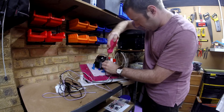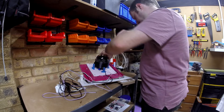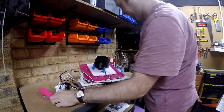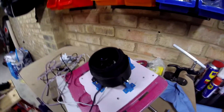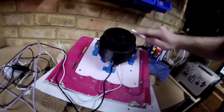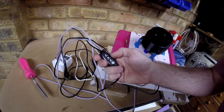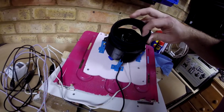You can mount it however you want. There are four screws to take the CCTV dome off. There is a little lip just around the edge which should keep it all watertight when the dome's on top. Inside, we've got a Raspberry Pi camera module — this is a high-quality camera module — and I sourced a 180-degree fisheye lens to go on top of that. The band around the outside is a dew heater, and there's a little controller for that with three different heat settings. Low is fine for most of the time; perhaps on colder times of the year you might use middle. I never really have to use high. That band just pops out.